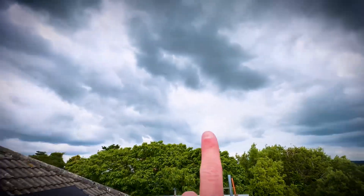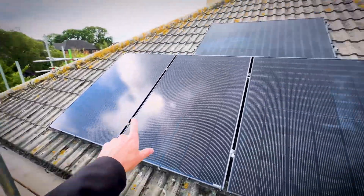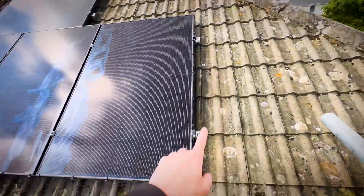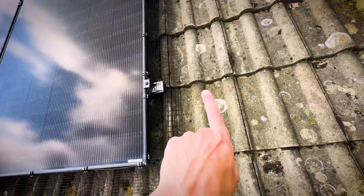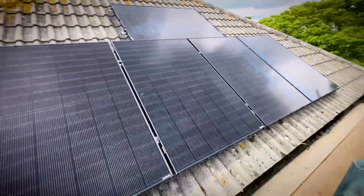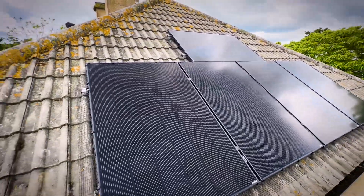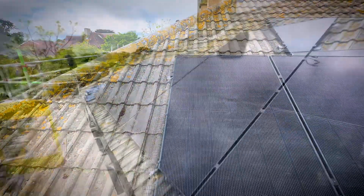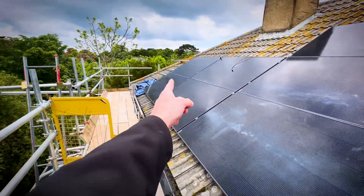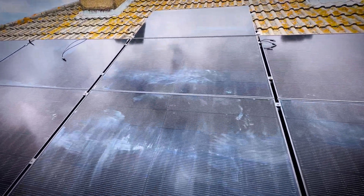It's day two now, but you can see by the big black clouds it's not as sunny as yesterday. We've got bird proofing on and these five panels. Got our end caps on, cut rails down - see the end caps there on the end. They're all on, just need to clean off - they got delivered with fingerprint marks on there so we didn't clean them off. This side's pretty much done now, just got to finish off over that side - just cutting the rail down and powering them up. All on this side, all square. Just got to cut the rails off that end, replace a couple of tiles, plug them in, get them tested, give them a wipe.